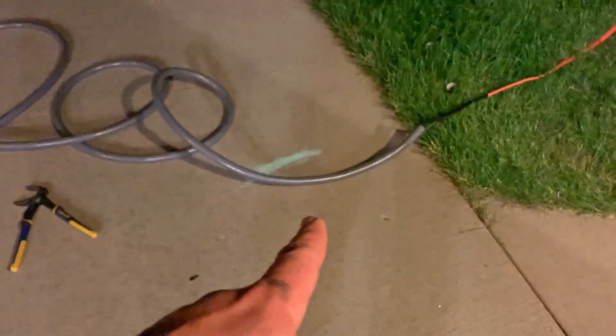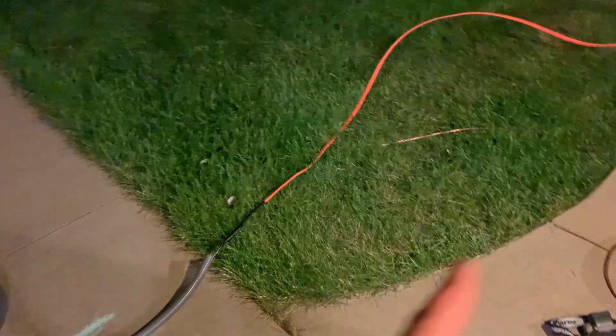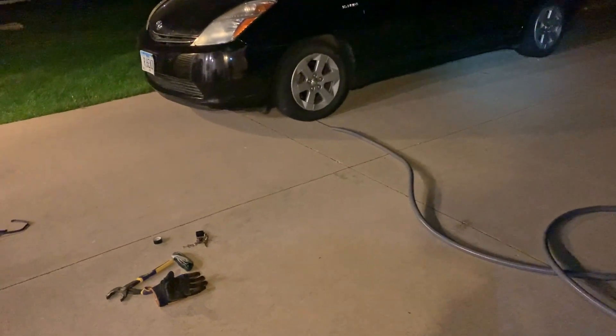Sturdy enough — I think we got it. Now I'm going to go all the way back there and start pulling the conduit over the wire, making enough slack so when it's all said and done this end of the conduit will end up right about there — with electric wire and ground wire all the way through it. Okay, I got everything ready. Here's my conduit, the end of the steel tape under the car.